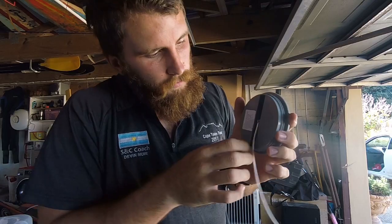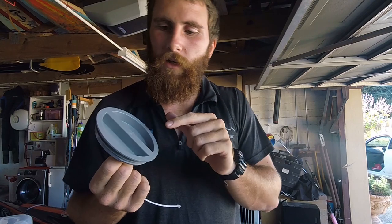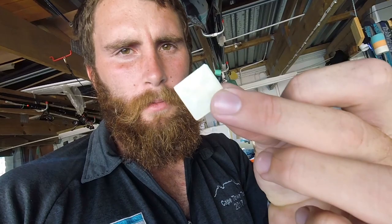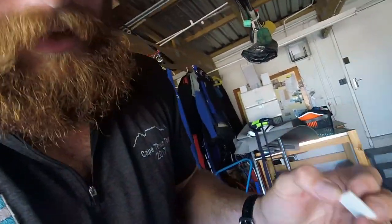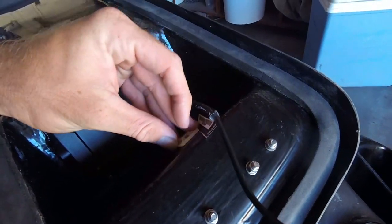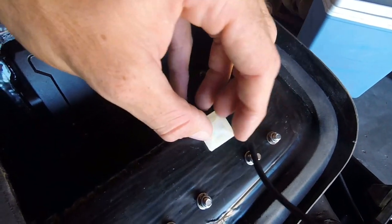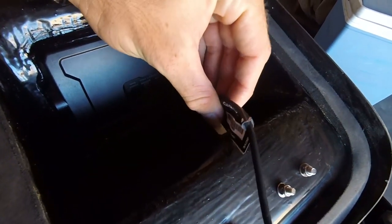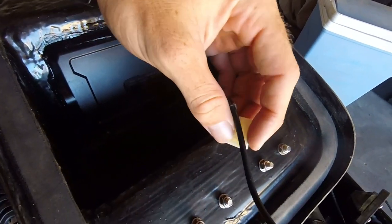Basically, you're going to take this piece off and drill a hole through it for your transducer cable. We need to keep those cables secure from getting pulled out by fish or when you take out an anchor or whatever. These little tight clips come in handy — take the sticky part off, measure it up, and put one here and one here. You'll epoxy it on nice and hard — I'll do one for each cable just so there's less stress on the connections.